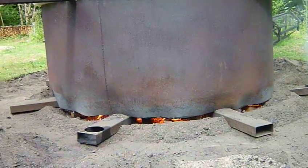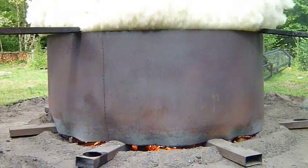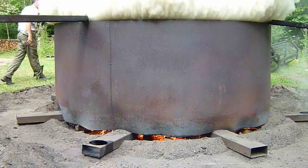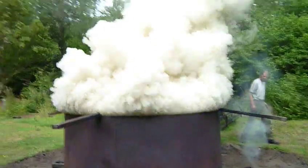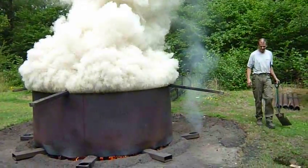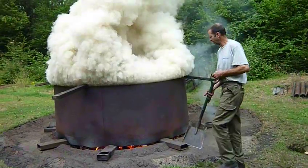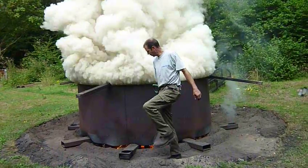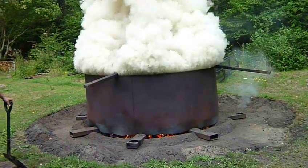You can see where they're all crinkly around the bottom. I'm hoping to put this kiln on its side and try to hammer some of those out this winter. I'm just going to step back so you can see the whole bloom. You can also tell when the heat's coming across because the sand here gets burnt, gets singed — it goes white. So that's a pretty good indication. You've got a nice lot of heat there.